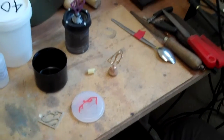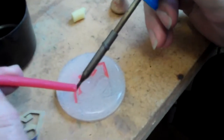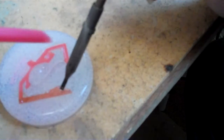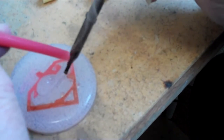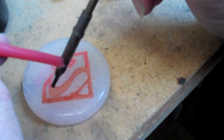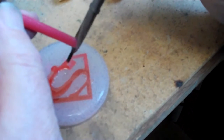We use this to make our Lost Wax, and the easy way of running the wax in is to use a cheap 15-watt soldering iron and some pattern wax, and just allow it to dribble down into the mould. The first time round it will contract a bit and the top will be decidedly concave. So before it goes completely firm, go round again and build up a little bit so it slightly overflows the mould to give you a surplus.